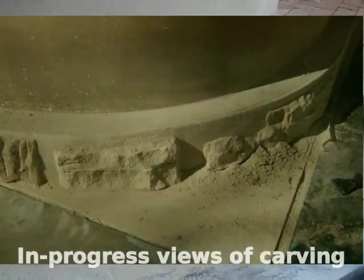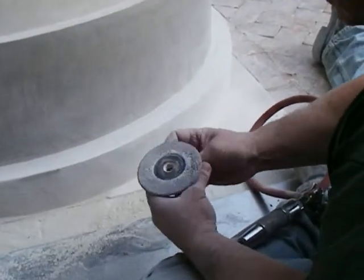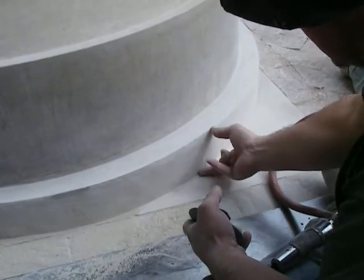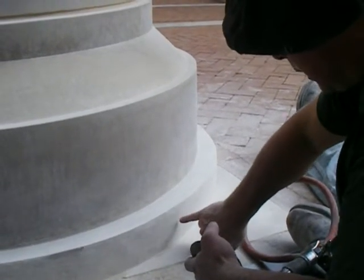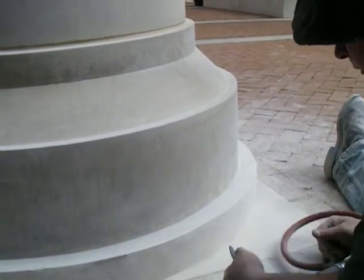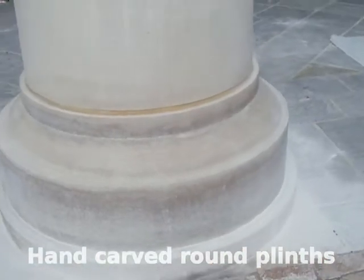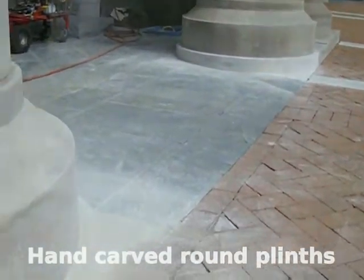Then hand machines to help clean it up. I'll finish it with an abrasive wheel here for surfacing soft stone. These are cut the typical way — slightly convex. These two points are a little further toward the center, so as you pull it down it'll produce a close surface. These last two corners have all remained — I've got the other ten corners done. Now they're round.